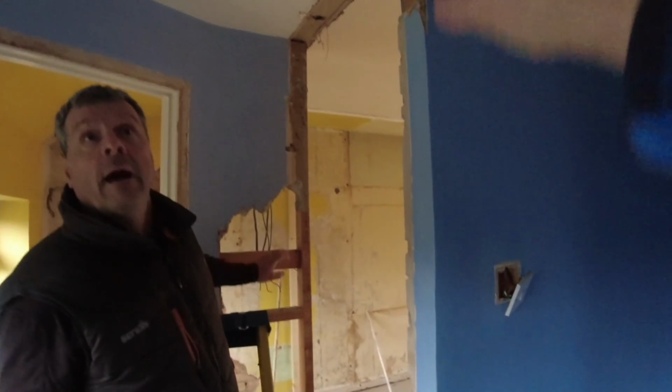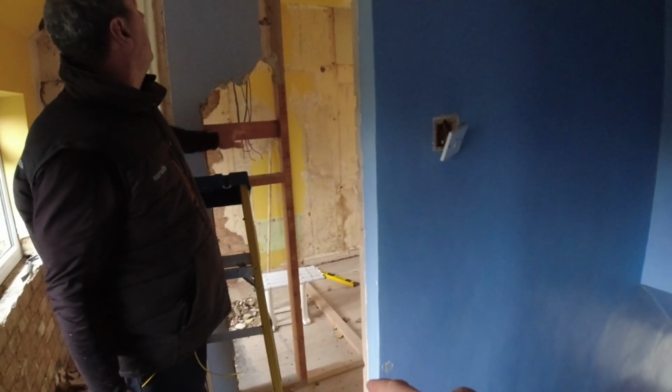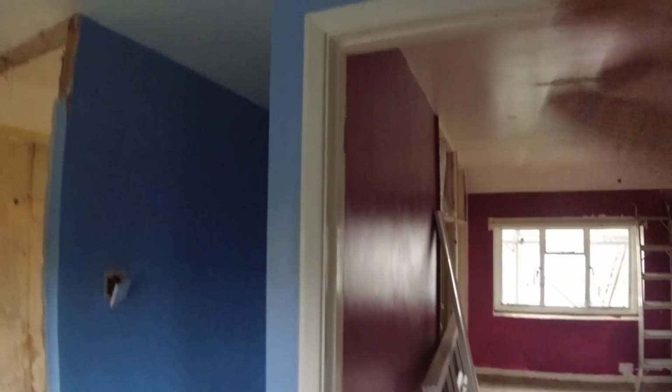What we're gonna do is start upstairs. So loft is a big loft. Because this isn't getting done till like April next year, we're gonna pull a socket circuit up there. We're gonna pull a lighting circuit up there. We'll find a place we can come down, probably be in this partition wall, Andy. Yeah, it's in a zone. We'll come down in that zone. Right. And then we're gonna start upstairs.